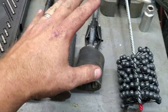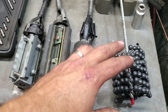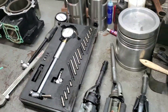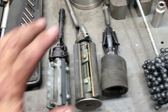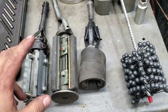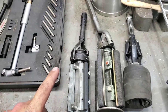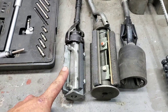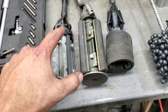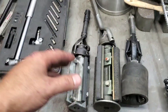If you want to put a light crosshatch on a cylinder that has already checked out — and it has to check out before you start honing — this is what you use. When you put a hone in a cylinder it's basically sandpaper; you're removing metal. If the cylinder is too loose and you remove metal, it's going to cause issues. If you want to size something, these rigid hones — especially the Sun hone — you can go up a quarter millimeter, half a millimeter, even three millimeters if you want to sit there all day honing it.